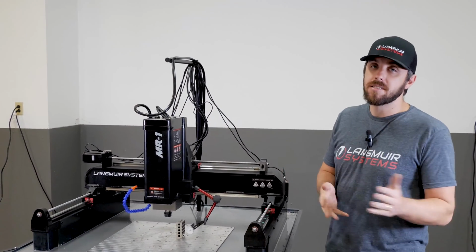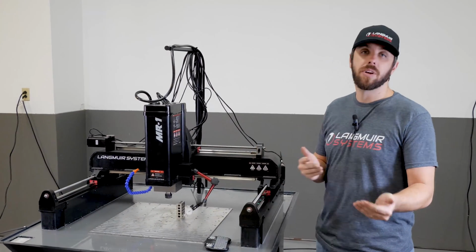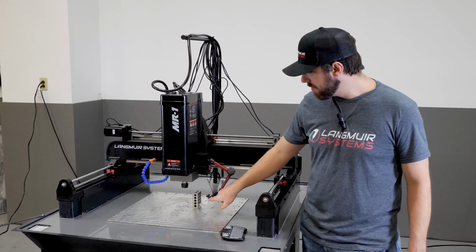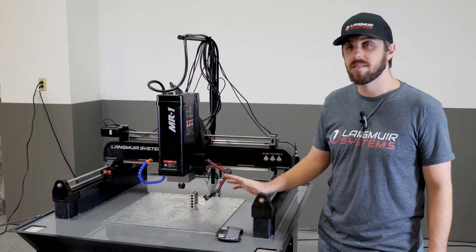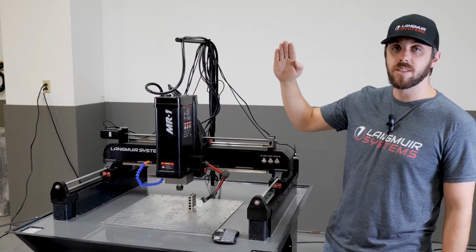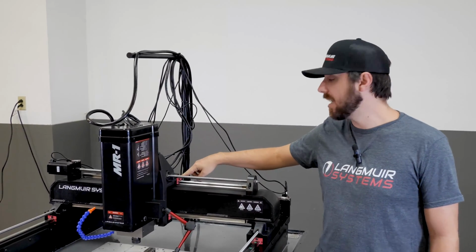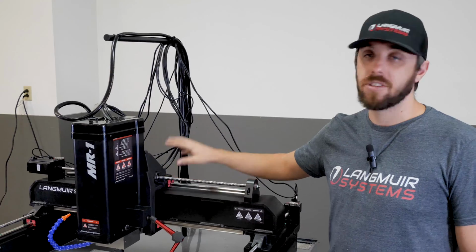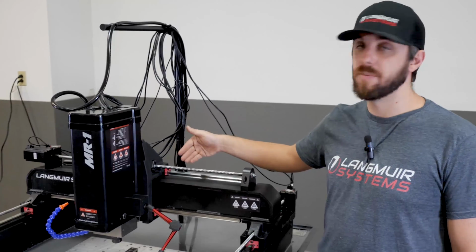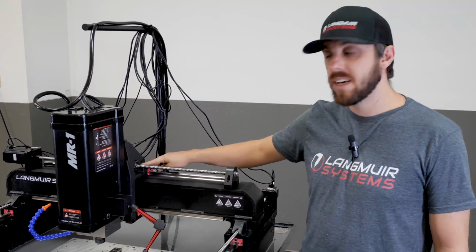With that being said, some of you out there may want to try to dial this in as perfect as you can. And to do that, that's where you need to start playing with your shim stacks. Because my indicator tip was starting to sweep clockwise, what that's telling me is that my nod of the spindle is kind of pointed this way, which means that I would have too many shims between my upper bearings and my XZ carriage. So on this particular machine, I know that there's 3 shims, which equates to a little bit over 3 thousandths of shim stack between the upper bearings and the x-axis carriage.